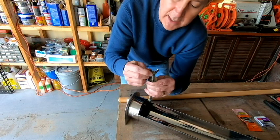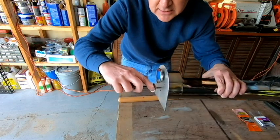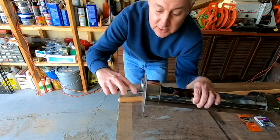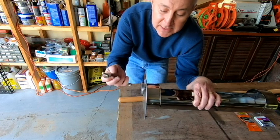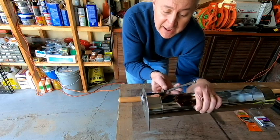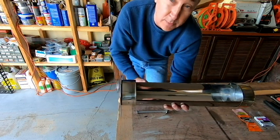And the reason that I'm going with a wing nut as opposed to just a regular nut is we want to be able to take this handle off periodically, and there's going to be a couple reasons to do that. Number one, with the handle extending out the front of this, this tray is not going to fit into the tube when we store it away in our toolbox. So we want to make it convenient so that we can pull the handle off whenever we want and put this whole device right into the dishwasher. And normally it's not good to run wood through the dishwasher, so we're going to take our handle off for that. But more importantly, when we store this away, we'll have that wing nut. We can just pop the handle off, reverse it, and have the handle on the inside and the wing nut on the outside. And then this tray is going to fit right into our glass tube, and we'll be able to store that away whenever we need to transport or just put it away for later on.